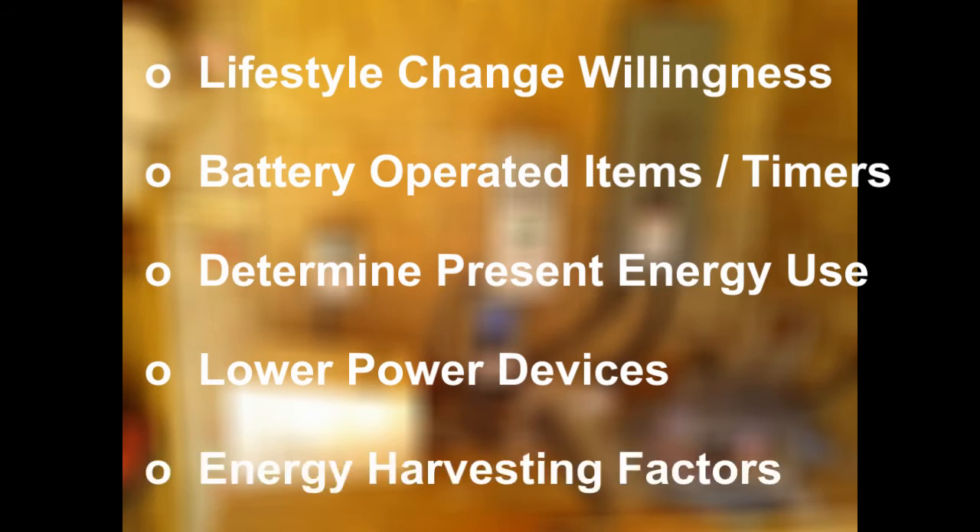You also want to study where you'll place your solar panels or wind generator. Consider the average sun hours available during the day or average wind speed. Look at structures, trees, and buildings in the area. A wind generator must be considerably higher than the highest thing within 300 feet. For solar panels, avoid any shading — if even a corner of your panels is shaded, it restricts the output of the entire array down to what that shaded cell is producing.